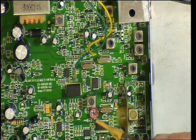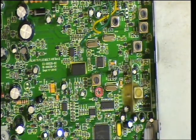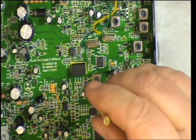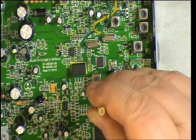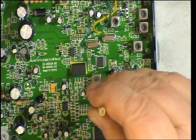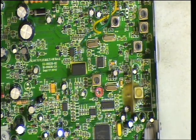The frequency is set with the 4.5 MHz oscillator, which is just here with CT201. At the moment we've got 27791140, so it's slightly low. It should be 27791250 with us being in the UK. So I'm just going to use my yellow trim tool to bring that up. There we go — 27791250.